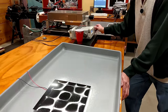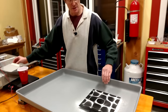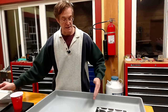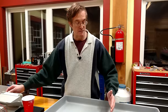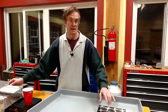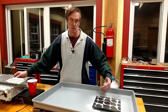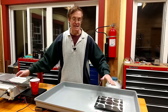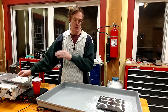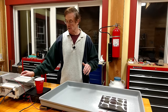One of the things the manufacturer recommends is not cutting these plates perfectly symmetrically, but cutting them as a rectangle. The idea is that there are going to be two resonance peaks for every one of a square panel. Because the entire plate doesn't participate at any particular resonance peak, the amplitude isn't as peaky. So more peaks of lower amplitude is much better.